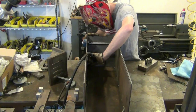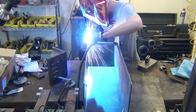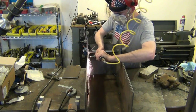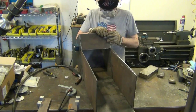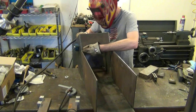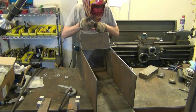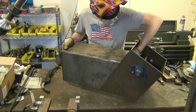At this point I install bearing pillow blocks and a dummy axle to further help keep alignment during welding. The lower front plate is checked for fit and a small amount of metal is ground down so the plate lines up better. I push the plate in place with a steel block so that all the edges are flush. Next the bottom plate is positioned and tack welded.